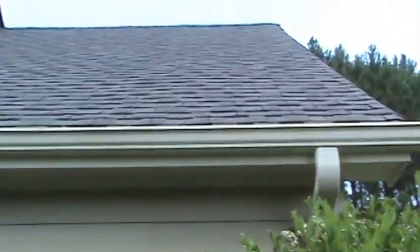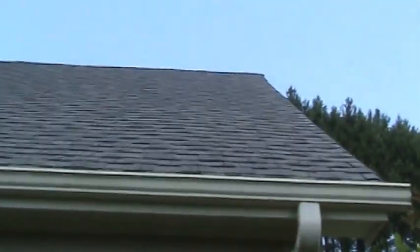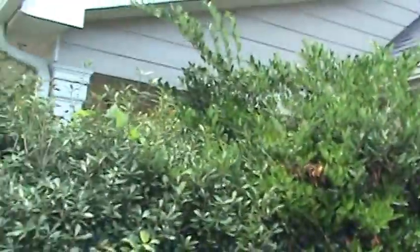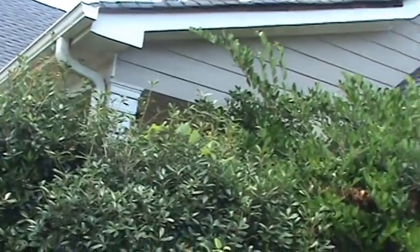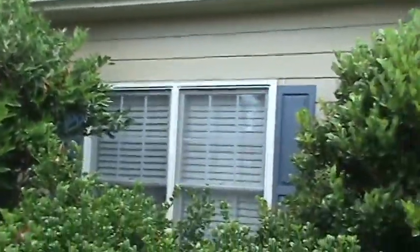It's got adequate pitch judging from here, but my boys will need to check it with a hose. With this pitch of roof, you've got to have a six inch gutter. Some areas of five inch will do okay, but his roof here is just so steep — you can see it on the garage side. The water's just streaming over the top. On the back of the gutters, the water's actually getting behind them, filling up and flowing behind. So he doesn't have rotted wood there, but he will.